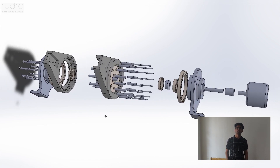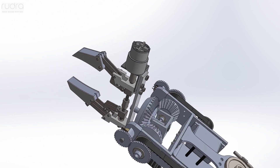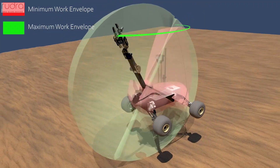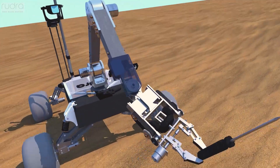The forearm of the manipulator is made up of aluminium box channels supported by an arm made up of two aluminium square channels. The arm is actuated by two cycloidal drives, an improvement from the previous year's design. This configuration provides increased work volume, rigidity, and precision, as it can stop at any specific angle. The arm-to-chassis turntable joint has been made modular, making the manipulator an independent system.